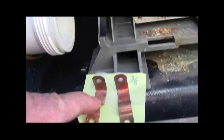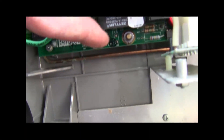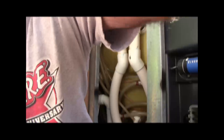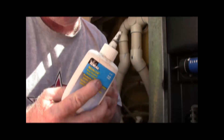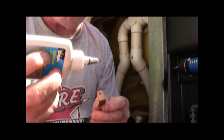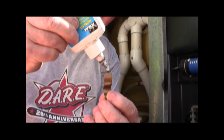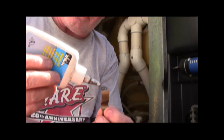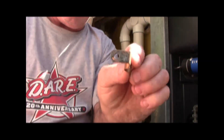These are the original electrodes, which get hooked on to these connections. Now these need to be reconnected to these supply electrodes, which are provided on the mother panel. Before you put on the electrodes, you want to use a Nolox or Deox — again, this is not a brand endorsement, but a product that you need to use. Put a very small amount on the contacting electrode; it does not take much at all. This is not required by code, but it's highly recommended for any electrodes that might be in a moist environment.